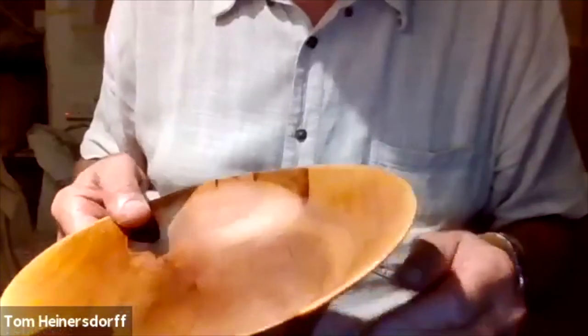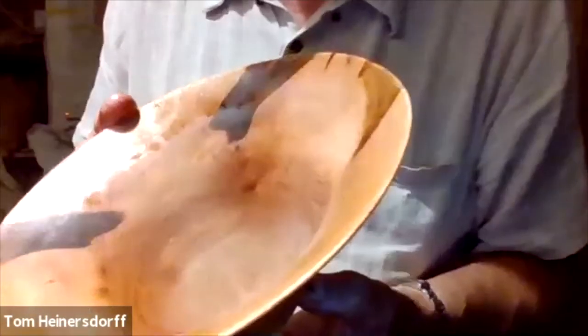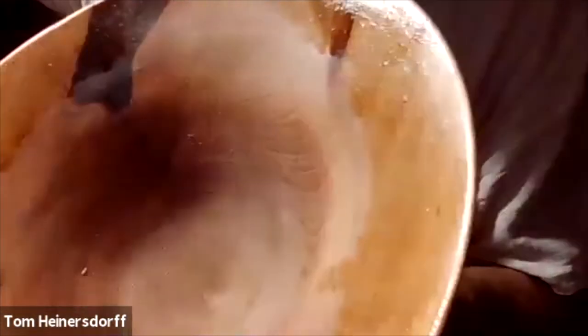You turned that green? Yes — you didn't let it dry and you didn't rough turn it. Was it rough-turned before you finished? Not at all — I turned straight to this shape. And you won't crack? Well, I'll let you know, but my plan is not. Last time I did one of these green it didn't crack. Because it's green it's really friendly to turn — the beech is such lovely wood. It only took about a couple of hours to get to this. Can you see the grain? You can see the grain really quite clearly with the oil showing it up inside. Yeah, it's beautiful.